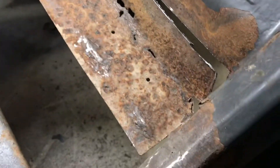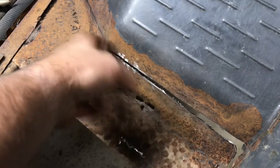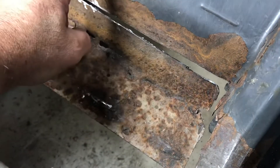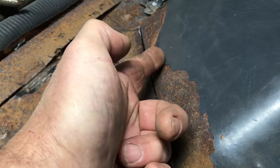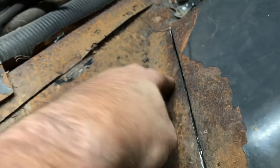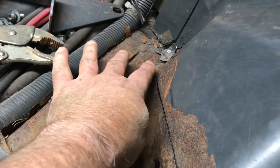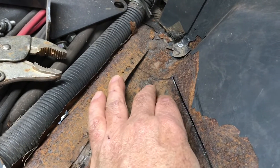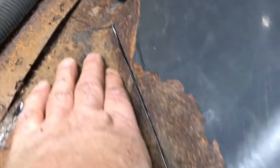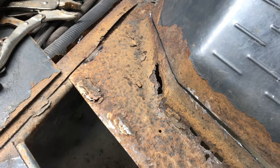This piece now has to be cut out. I just arbitrarily picked a position where it still had enough good metal - I could just grind that down and get some protective paint on there. I came down 60 mils from here, and over here I was going to go straight - you can see the same kind of 60 mil line - but I decided it'd be easier if this line is higher here and tapers down to the corner. I'm going to cut across here and leave the corner in, as it's a little hard to get in and awkward to weld. I've got most of it cut now and just need to finish the final cut across here, then use that piece as a pattern and get some more metal going.